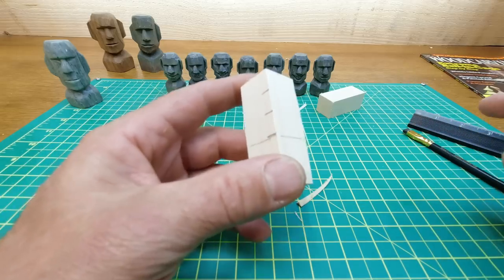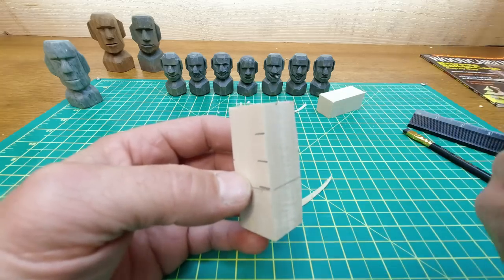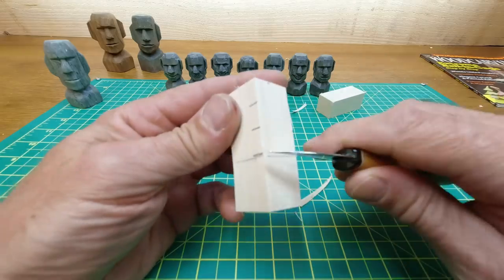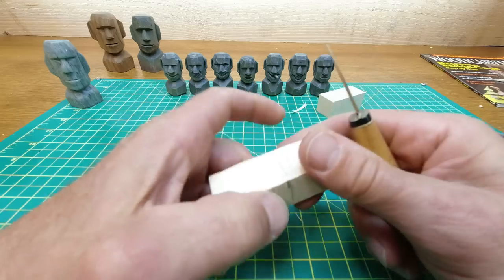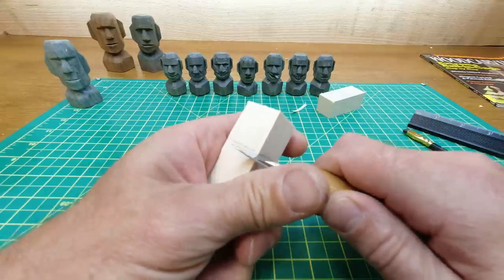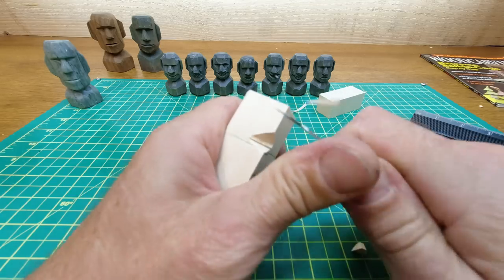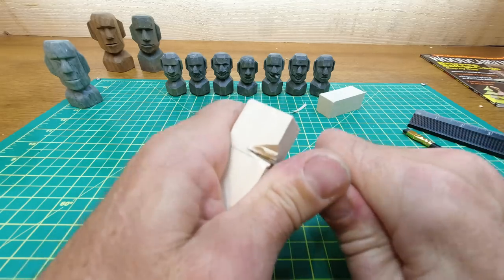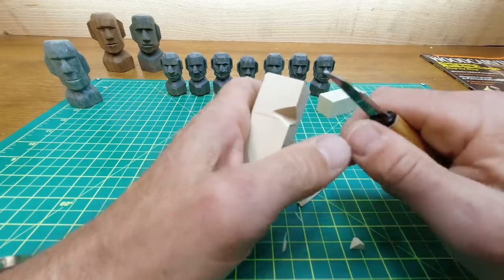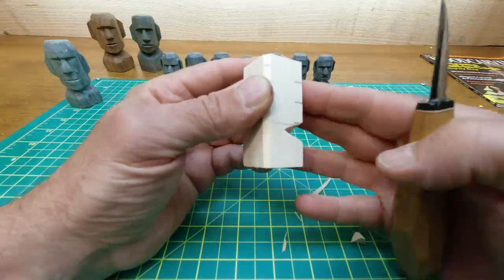People keep asking me what I think the easiest carving to start with is in this 1x1 series, and I think this will be it. This is a fun, simple, easy carve. So let's get at it. I'm going to start with the chinny chin here and I'm going to make a V cut from the line down. We go fairly deep — you can have a real big V cut. I'm digging that in there, going probably a real good healthy quarter inch, almost three-eighths. You can see that's below the line.